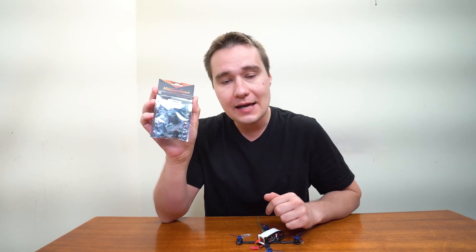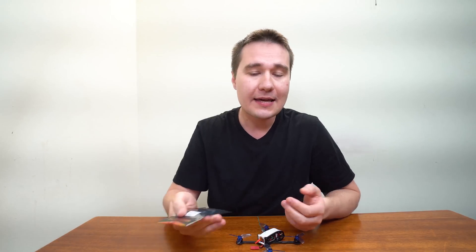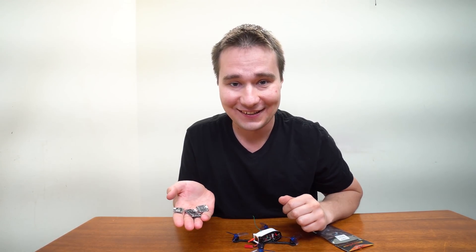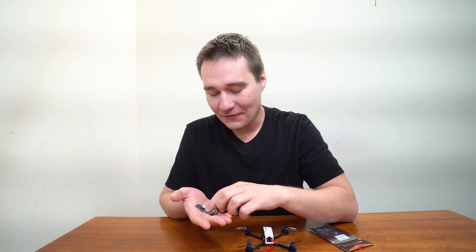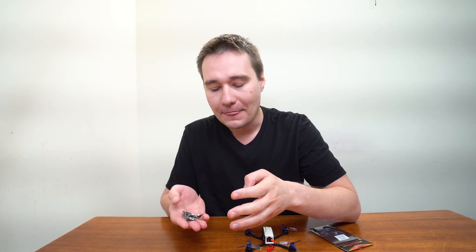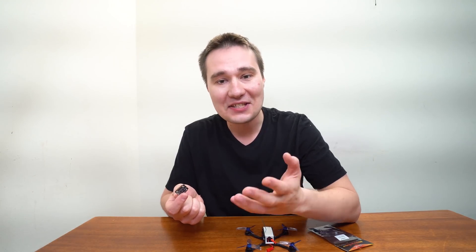It's the Happy Model Super SF4 flight controller and ESC stack, and I was really happy about it because it's all kind of plug and play — pretty much just solder the motors and that's it. But it was just the beginning of the story, and you can see I've got a few of them here that didn't really work for me. The first mishap happened when I built everything, tried to bind an FrSky receiver, pushed the bind button, then plugged in the battery and it shorted everything — I burned one set. What was interesting was the speed controller burned, which I didn't expect; usually the flight controller burns.